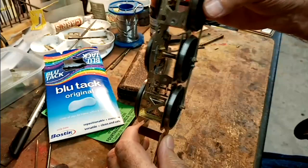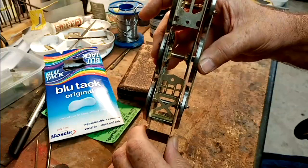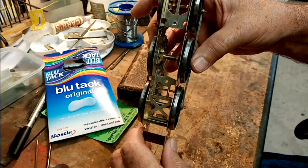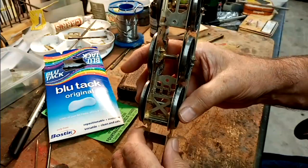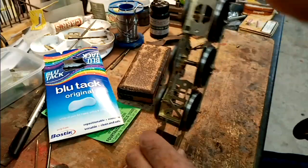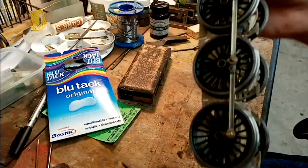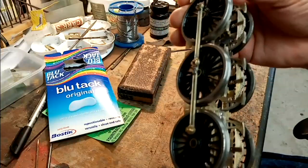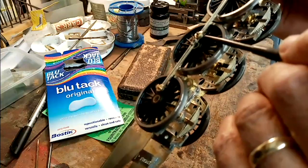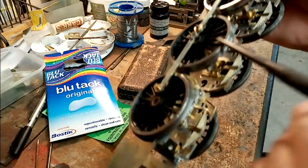Now, I don't want the minimum, I just want the minimum of clearance on the front axle. I found really on the middle axle that if I have a millimeter clearance, that's as much as I need, and I don't have any clearance or minimum clearance on the back axle. Also, what I've noticed is I've put one 8BA bush behind the coupling rods, but it's not enough, as you can see. Perhaps you can see, I don't know,